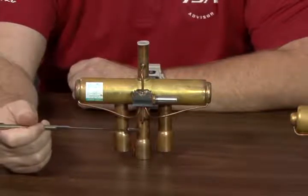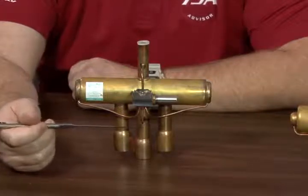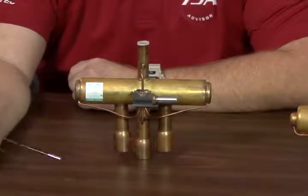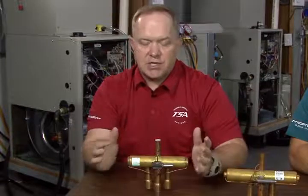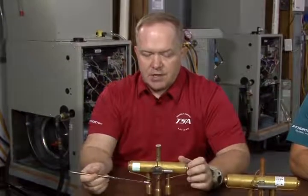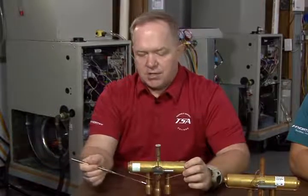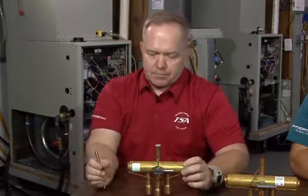Conversely, the temperature of the true suction line, the return cool vapor back to the compressor, and those two lines also should not be separated by anything greater than 3 degrees. That's classically been taught, trained, and put out to the field. If you suspect you have a reversing valve that's hanging up, you should likely see elevated suction, reduced discharge, and poor performance, obviously. And if you test across these lines, you should not have anything greater than 3 degrees from discharge to discharge, or from return vapor suction to suction.